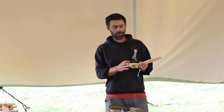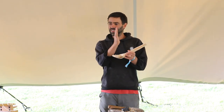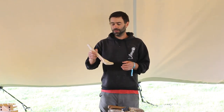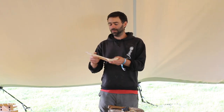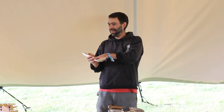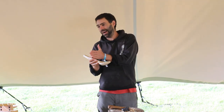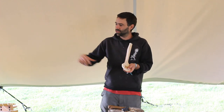I normally try to have that back wall quite steep. Because when you go into stew or whatever and lift it up, you're lifting it - the tip sort of comes out of the liquid. If you want to increase the volume of the ladle or serving spoon, you want to have that all at the back. The front is thin and narrow because the grain's running through it - you want it nice and thin and narrow so it just goes through liquid to scoop it up.